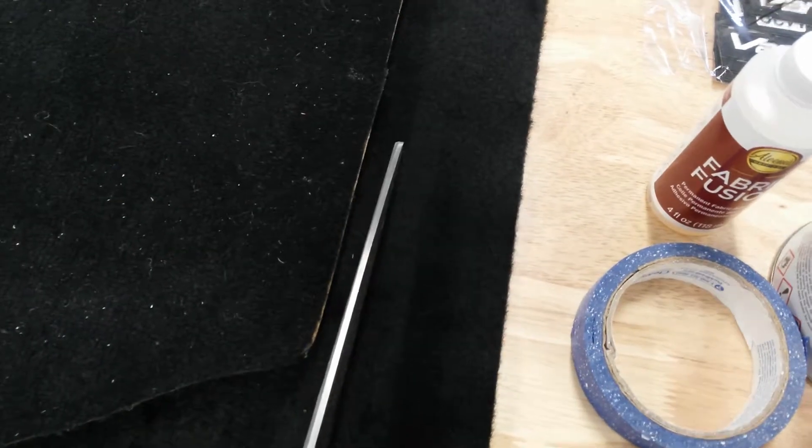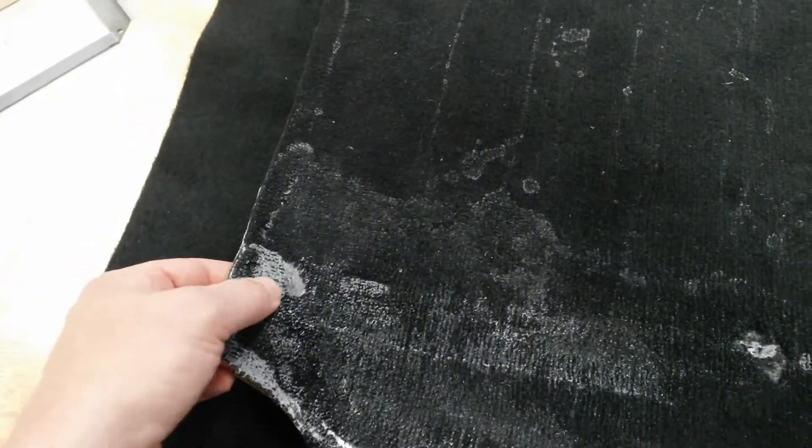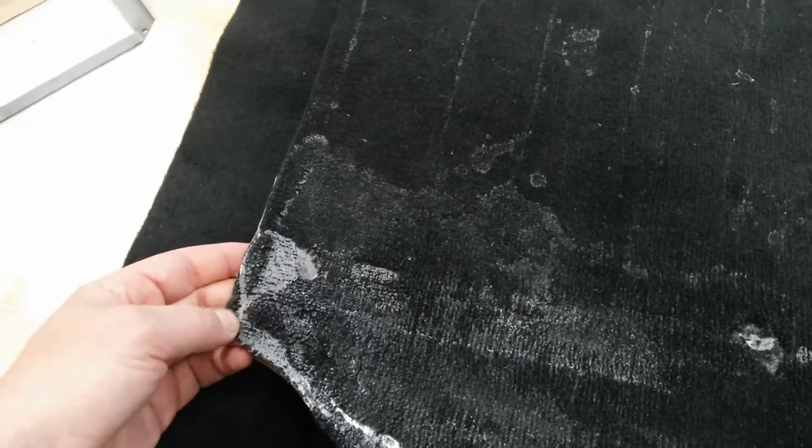I'm doing this on my phone because I can't find my camera. First step is to cut the carpet. I'm going to go a little bit more on the sides because I have to cover up the other carpet that got eaten away — I'm just going to overlap it. You can make it a little bit longer and then trim it after it's in. You can mark it with chalk or whatever, but a rough cut would be fine.